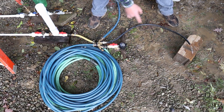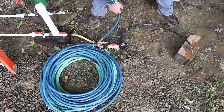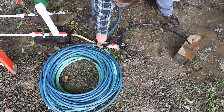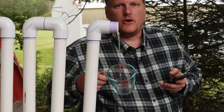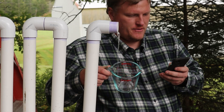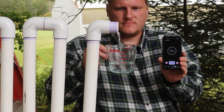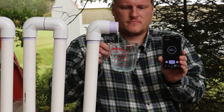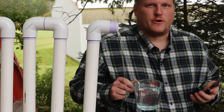I have now purged all of the air out of the system. We can see it's not flowing very fast because there's now about 150 feet of hose there. Now watch how easy this pump starts up once I shut this valve — there, it's going on its own. Let's test that output again. And time — 43 seconds.